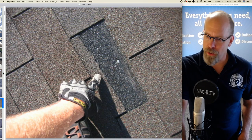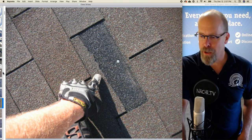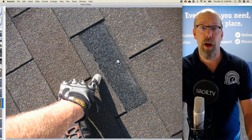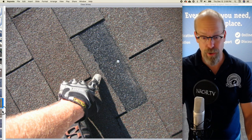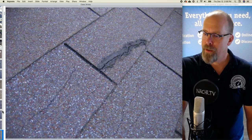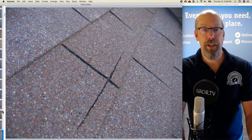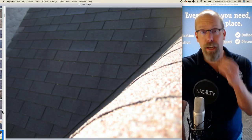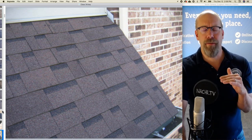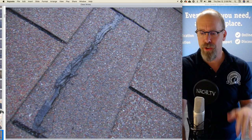So here's one shingle tab that is cracked off, and it has exposed the shingle material underneath and also a fastener. And any fastener with an exposed head is a potential water entry point. So that's no good. There's another one. And more defects. So this roof is a major defect and in need of replacement. So I, as a home inspector, am going to look for signs of or indications of active roof leaks. Here's the front porch roof. That too is in bad shape.